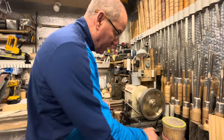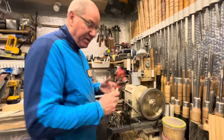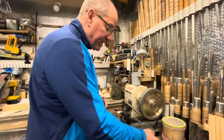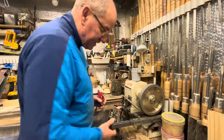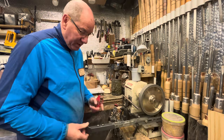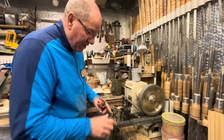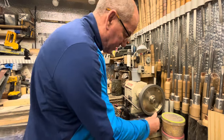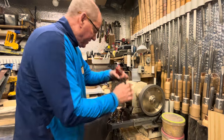And then this is a Woodcut TruGrind, you know, for this one. It comes as a set, the TruGrind. I got that, and I welded that onto the actual bed, so that's fixed, okay? And since then I've adapted it and I've made an extension here so it comes out so I can put chisels in there to do that grind. I've got the holes here. Most of my grinds, pretty much all my settings, are with that fully closed to there. It's all been done, measured out, and I have these two.